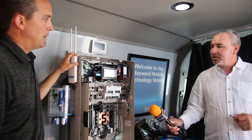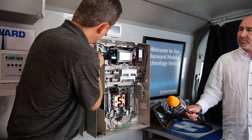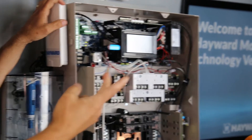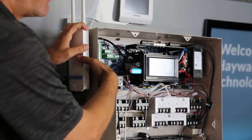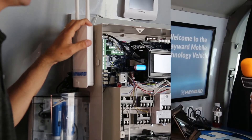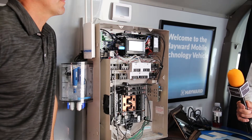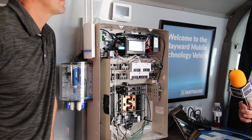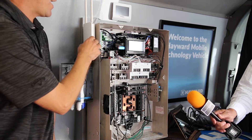How do you plug the heater and how many heaters can you wire? Up here we have low voltage sensors — LV1 heater, LV2 heater. That's your standard two-wire communication. You take the two-wire off of our heater or a two-wire remote off of any heater, wire it into the LV connection on this board. This is very similar to all the sensors you plug in, and you can also do them in tandem.